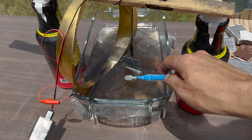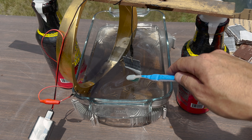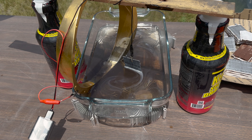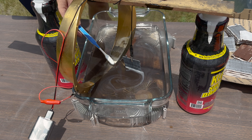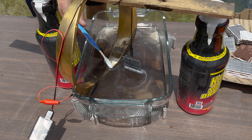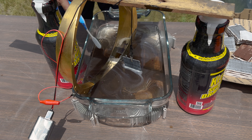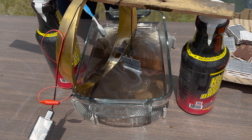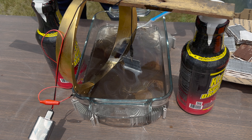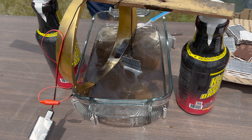You can see that this liquid is getting darker, which is exactly what we want — it means the gold is coming off into solution and staying there. The metal is seeming to adhere it back on though; I may have to run this ring around in here a few times. This is my first attempt at reverse plating and it's kind of fun — it's working. I expected it to work, but not having ever done this before, it's interesting.